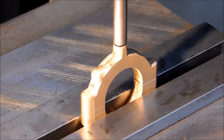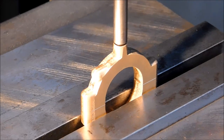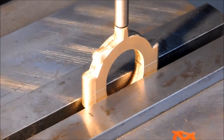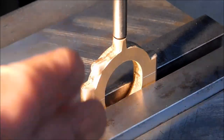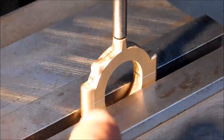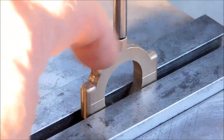First step in the assembly is to figure out some reference point as to exactly where you're at. If this were a critical solid rod that was driving directly into the valve through fixed points like the gland, the end of the cylinder, the way to do this would be to crack this part in half, not crack it, saw it, machine it, whatever, fit it back together, screws, everything, bore it, then put a pin in it, indicate either side of the pin to find your zero, and then find the center of the part and drill the hole.